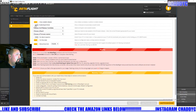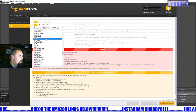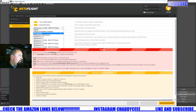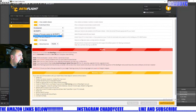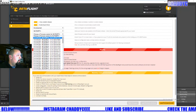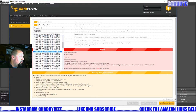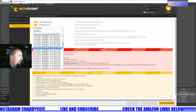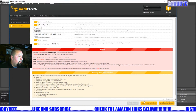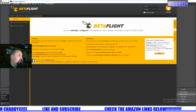So we can go ahead and disconnect from here. All you want to do is click on Firmware Flasher, click on Enable Expert Mode, go ahead and select your flight controller - I am using the Tempest F4 - and we're going to look under development, then choose what firmware version we want. There are all kinds of different builds starting with the latest nightly build. We'll drop down to version 222, which is one that Mark recommended. Full chip erase, manual baud rate, load the firmware, and flash.